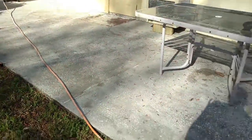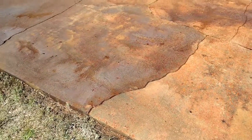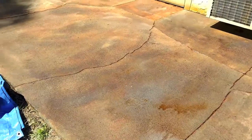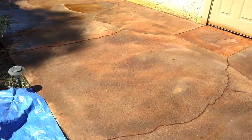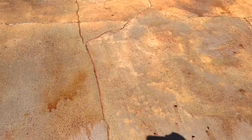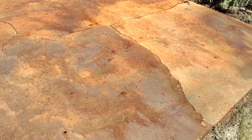That's about all you're safe with on a substrate like this. We've V'd out all these cracks sort of to resemble stone, and the substrate's drying right now. Applied the acid, and then we're gonna neutralize it and seal it up tomorrow.